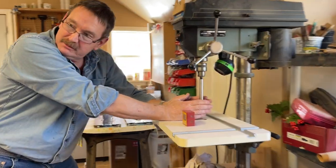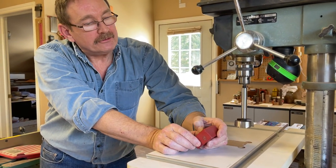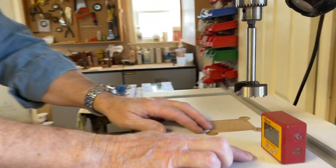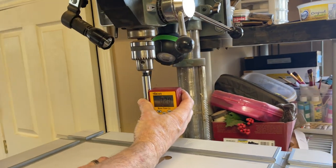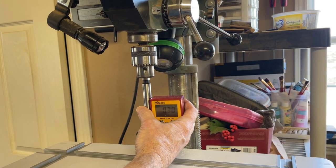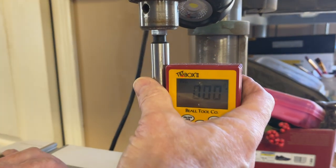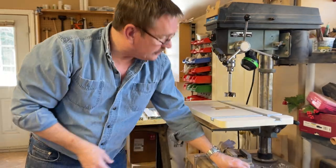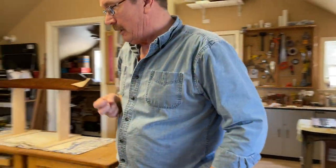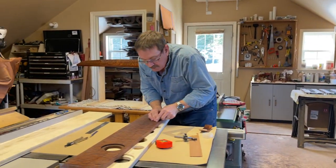Now we want this to enter the wood square and even, right? So this is called a tilt box. And it tells me my table's at zero, exactly level. And my bit's at 0.3. Wow, you're precise. Zero, okay? So this is perpendicular. That's a good thing. Otherwise I'd tweak the table a little bit. Yeah, okay. I understand that. I probably wouldn't have thought of it, but well, now that I know. Yeah, you can make a little bit of a mess going into this. And I'm going to...